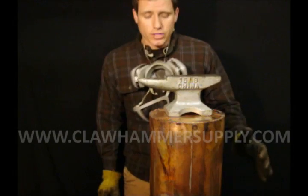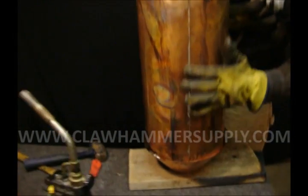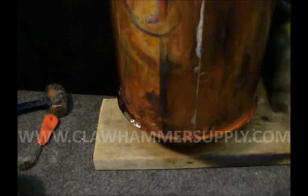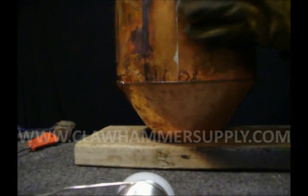It's very important that when you get to the joints that have already been soldered, you don't heat them directly when joining parts. I'm going to make my way around from the side of the boiler and the vapor cone to the seam, and once I get to that seam I'm going to stop applying heat to the boiler and apply all the heat to the vapor cone below.